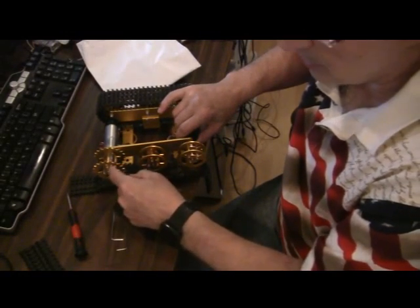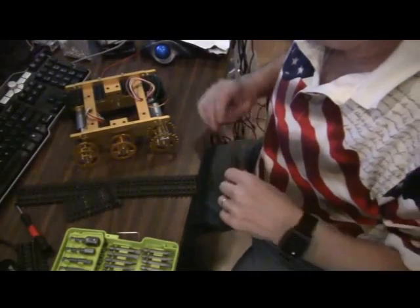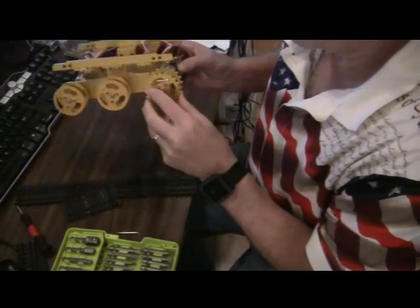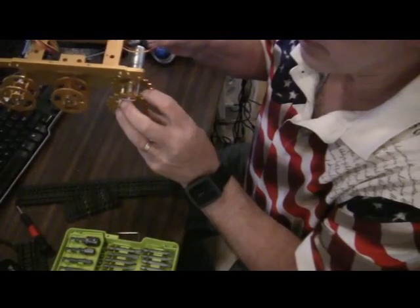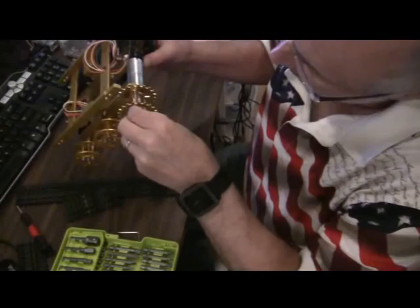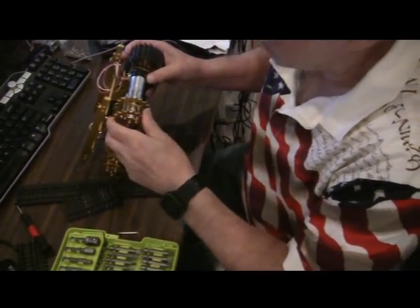I'm going to change these because I set them up wrong, and I'll be right back. I didn't align those two holes. Okay, so what I've done is I realigned these top, I'll show you on this wheel, that top hole. They're aligned up for both wheels. And I took the middle Allen wrench and I shoved it through both of them. And then I got the Allen wrench, which just slid out, up against, by turning the wheel, I got the Allen wrench up against this bar. So now, despite the fact it can fall out easily, I cannot turn this anymore.